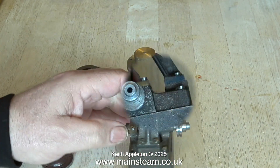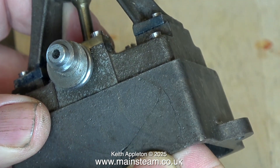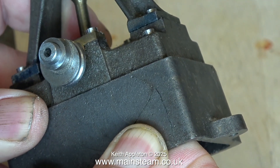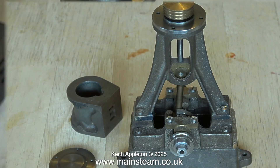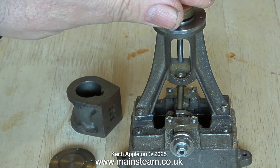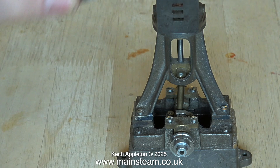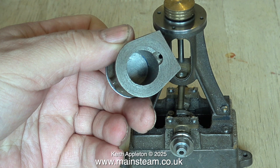There is a bit of a problem with this engine — I noticed it as I was handling it. The base is broken; it's obviously been dropped. These bases on Number 10s are not all that strong — I once sent one in the post up to Scotland and it got broken in transit even though it was well packed. The easiest fix would be to use some JB Weld on the inside of the casting and smooth it out; no one would ever know once it had been filled and painted. I may have a spare base in the workshop, and failing that, they are available from Stuart Models and they're not expensive.